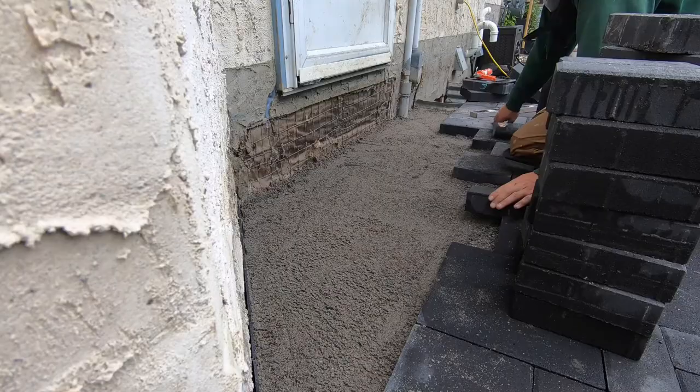It really is that easy to fit them in place after you've laid your snap edging. I prefer to lay all my pavers first and then make my cuts because you get a nice straight cut every time. But it's a good thing I'm not doing that today because I'm missing that concrete saw — it takes a lot more time to score all your edges, snap it, and then clean up the middle than just making one solid pass with that concrete saw.